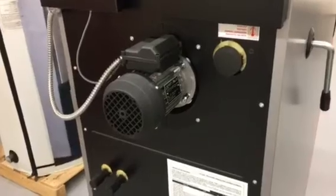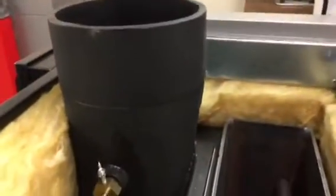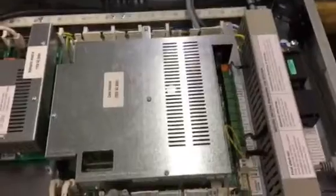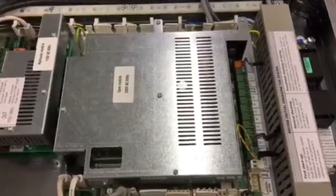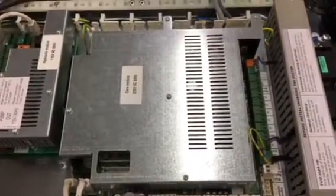On the back of the boiler is a variable speed fan mounted on rubber bushings so that it's very quiet. This fan pulls smoke up through the heat exchange tubes and out the flue collar. In the flue collar there are two sensors: a thermal sensor and an oxygen sensor. Those two sensors send their input to the core module, which sits on top of the boiler. The core module tells the primary and secondary air dampers how much to open and close, and together with the boiler temperature sensor, how fast the fan speed should be.